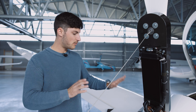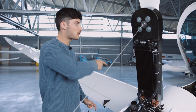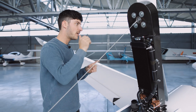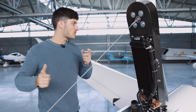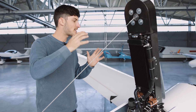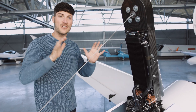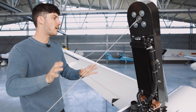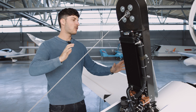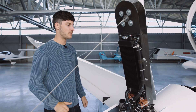Then it is time to prime the motor four times or so. Then we will rotate the propeller really carefully — even if we don't have the ignition on and the prop stop is partly aligned, this is a two-stroke engine and it can just start to run with rotating the propeller. So be really careful. Never position your head in this direction, always take care with your hands, and make sure there are no other people around the prop.